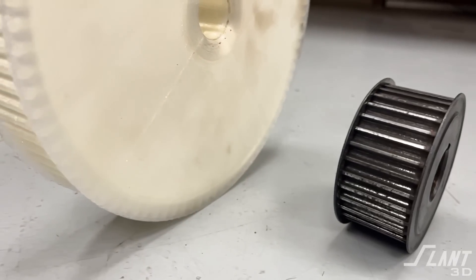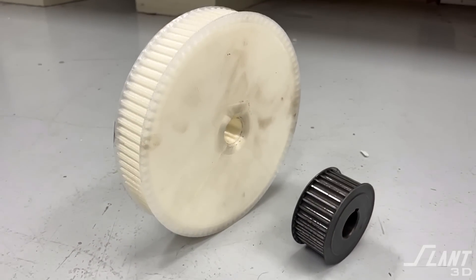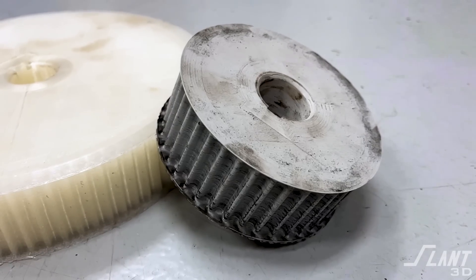Let's look at this in a production context and compare it to this printed gear. We needed to recreate this pulley because we needed one that was bigger, and we ended up creating a couple of different sizes — that's where the real value came in. Sourcing a different size of the metal pulley was very expensive and difficult, and it's also very heavy, which is tough for the machine to move. Making it out of plastic gives us a lighter-weight pulley with less inertia, and it allowed us to iterate through sizes — we tried about three different sizes in printed format.